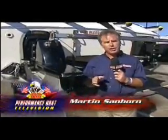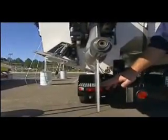We've heard guys talk about changing the setup for rough water conditions. One of the key things they've all mentioned is they'll put spacers in the drives. This is a spacer on a number 6 Mercury Racing Speedmaster. It's a 1-inch spacer that allows them to lower the unit — they space the lower unit down 1 inch, which puts the propeller shaft 1 inch lower in the water so they get a little bit more bite. They've got a little bit more skeg in the water for rough water conditions, which gives them a little bit better control.